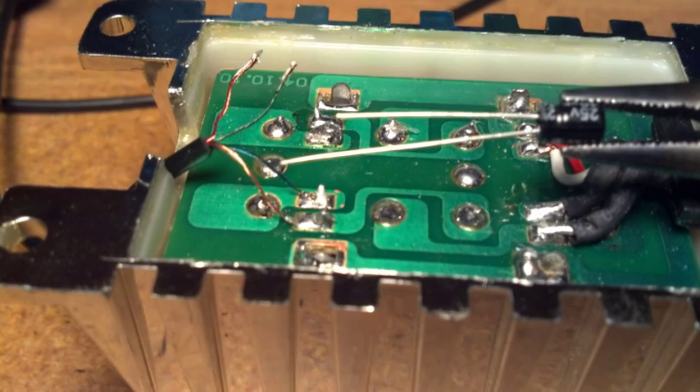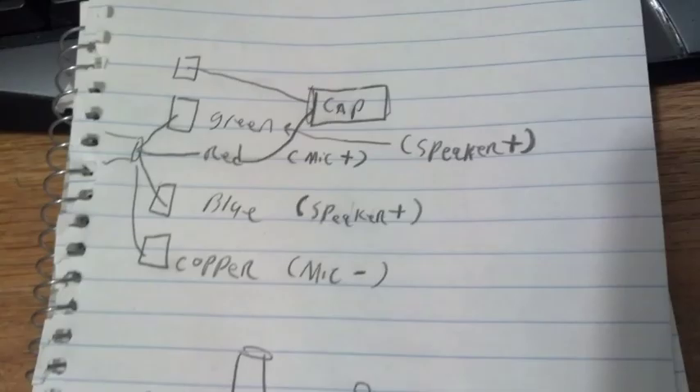Okay, here it is in the board — I'm beginning to solder it. I'm holding the capacitor up to show orientation. The short lead goes to the top, or to the last solder tab. And here is a zoom on the soldering points.